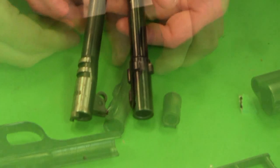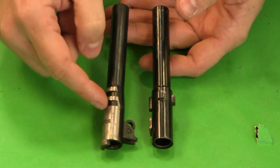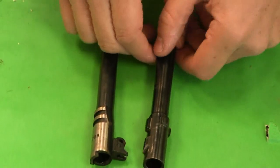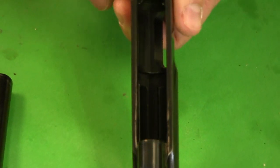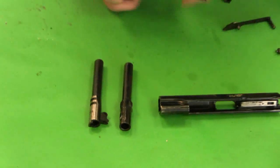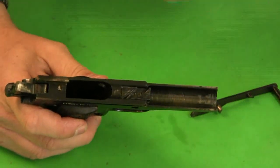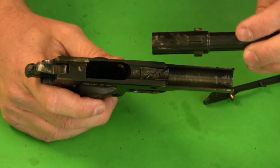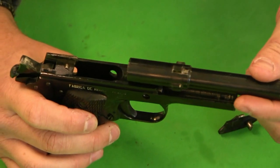That cam block and angled groove causes the barrel to rotate when the slide goes forward and backward, and that's what locks the gun. On a standard 1911 barrel, locking lugs are cut in the very top of the barrel and lock into matching recesses in the slide. On the Obregon, instead, there are four locking lugs cut around the circumference of the barrel, and the slide is wider to accept them, with grooves around the circumference of the slide. The locking piece sits on a pin machined into the frame. As the barrel goes forward and backward, it rotates to engage and disengage the locking lugs.